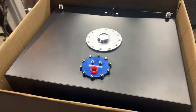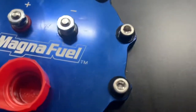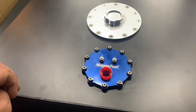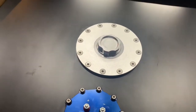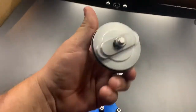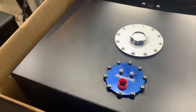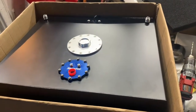There it is, all installed. When you're tightening these little allen head bolts down, it's got little teflon washers — don't tighten them very hard because it'll mess up the teflon washers. Also, if you buy one of these cheap eBay pumps, make sure you check these allen head bolts because a bunch of mine were half loose. The only other thing I'm worried about is this nut coming off, but it looks like they put red loctite on it.